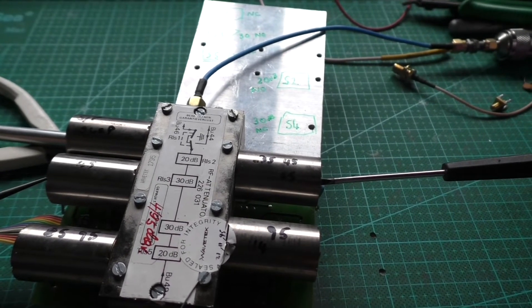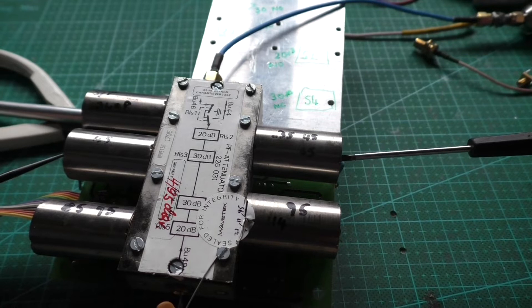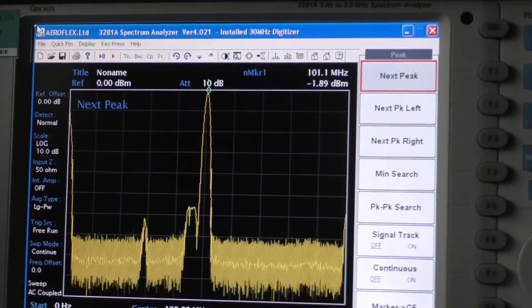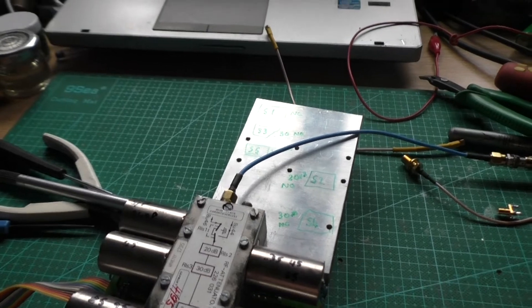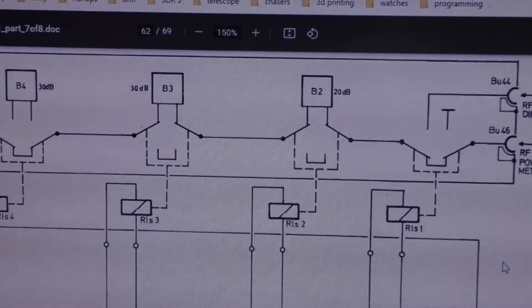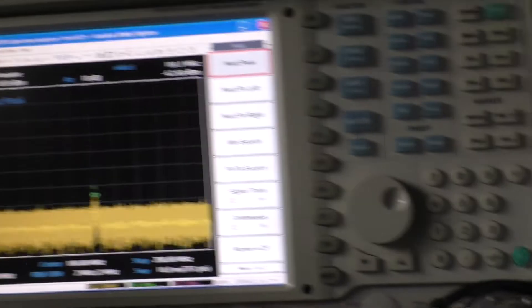If I engage the switch contacts from relays 2 and 3, which effectively removes all attenuation from input to output, I'm feeding in 100 MHz at 0 dB so I should roughly get the same out — and that's what I'm getting. Going straight through, based on the circuit diagram the only path with any dB attenuation is through B3 and B2, which should amount to minus 50 dB on the output, but I'm getting more like minus 70 dB.